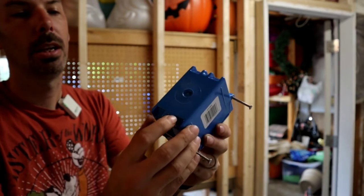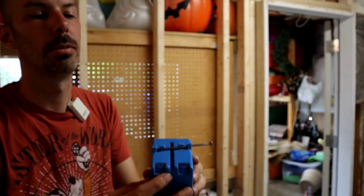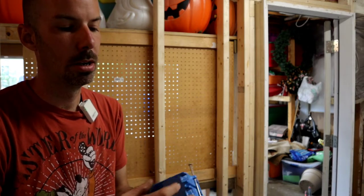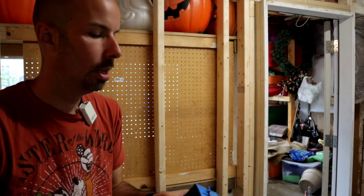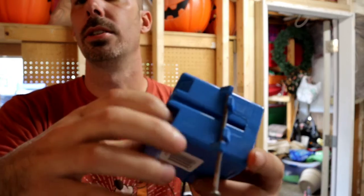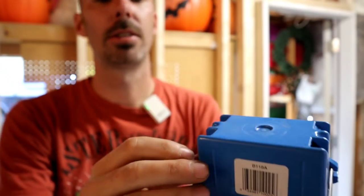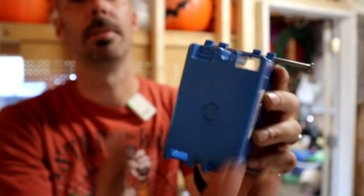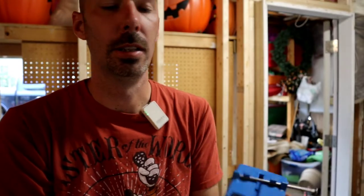These have little bust-outs, and those bust-outs are for you to run your cords in. We typically run in from the top and out from the bottom. I usually like to break out at least one and go the opposite side - that's just personal preference. It's actually easier to knock those tabs out before installing the box. I just punched it out with a screwdriver - it's held on by tiny little tabs, not hard to get out. The romex, or electrical wire, is going to go right through there.